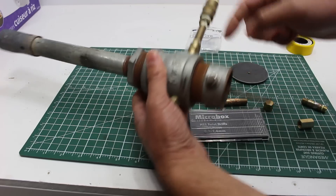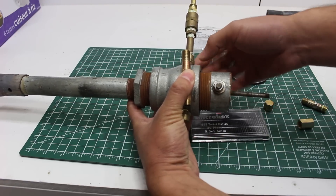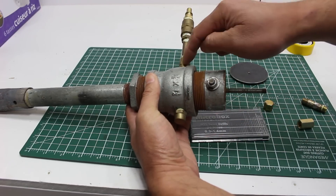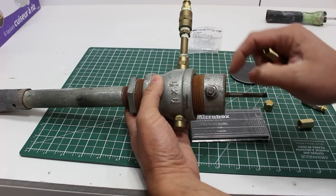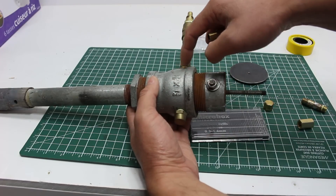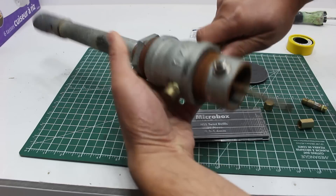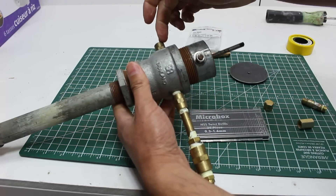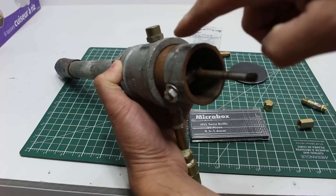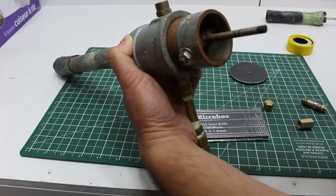Once I drilled the hole for the pipe nipple and got it positioned where I wanted it, I used the outer pipe nipple to tighten down and hold it in place so it won't move. The edge goes into the threads, so it's very important that you drill the hole where threads still exist in the coupler — when you tighten it down, it locks solid. Alternatively, you could drill holes on both sides and use a set screw or bolt to hold it in place. I didn't have a tap-and-die set at the time, so I used this method instead.